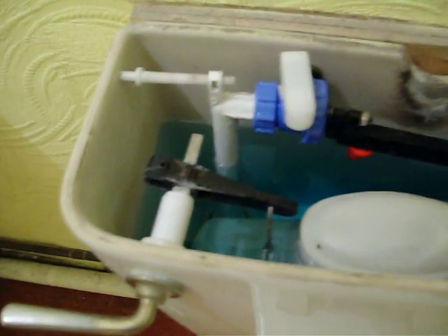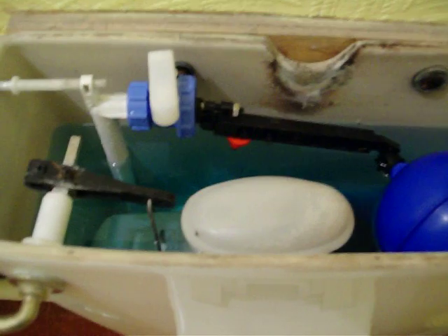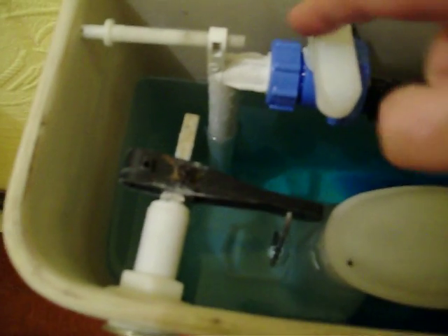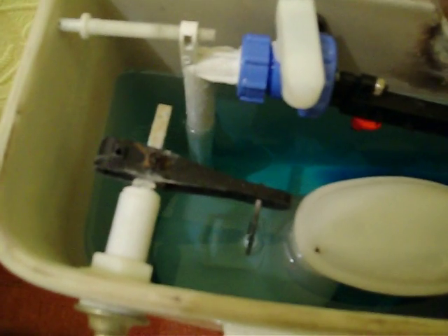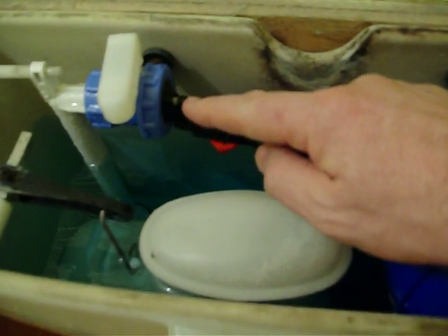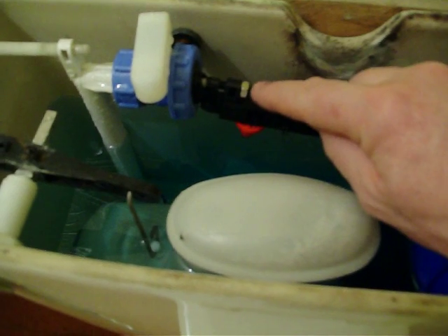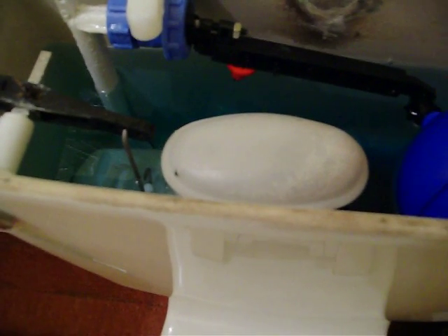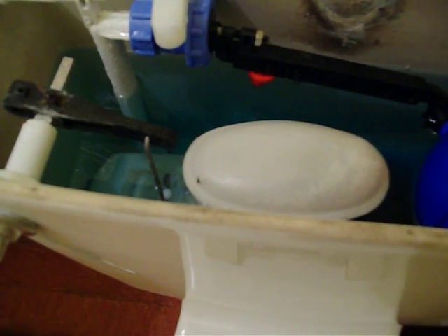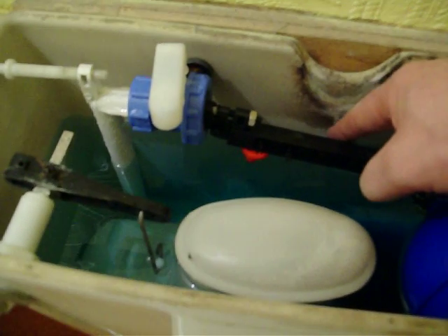This toilet doesn't actually have an outlet for the water to escape, so if that valve does fail it's just going to fill right to the top and overflow onto the floor. From B&Q this part costs £4.50 and you get the whole system — the ball's not on there, so you just take the ball off the one that's already there; it just unscrews anti-clockwise. There's really nothing to it — it's just a straight hollow pipe down to the bottom with a rubber washer on it. You can also adjust how high you want it to fill; it pushes that little pin in and stops the water.